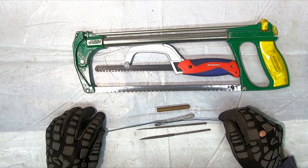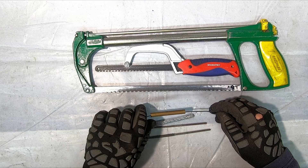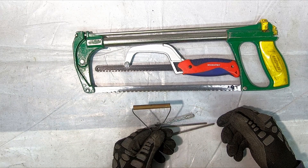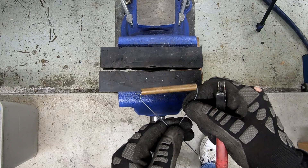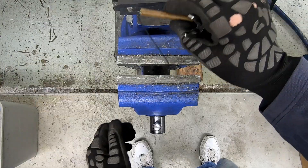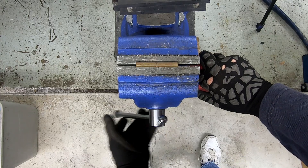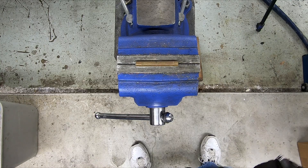So what is this piece of wire for? This is how you hold a piece of tubing like this in a vise so you can actually work on it. You've got your tube - you don't have to use this kind of wire, this happens to be rebar wire. Anyway, you stick it in the vise, get really close to where you're going to cut, grab the wire underneath with a pair of pliers, pull it down tight, tighten it up, and now it's not really going anywhere.